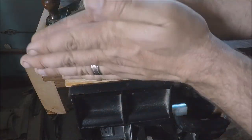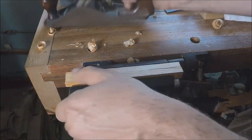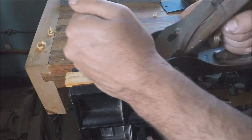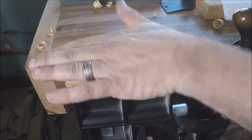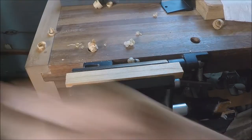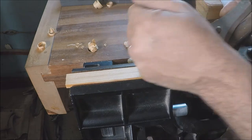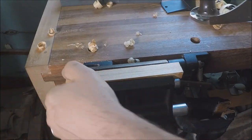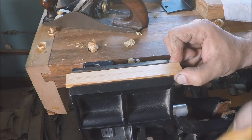I've taken those two pieces, laid them together, and lined up the ends. This is just a saw cut edge — it's a pretty decent cut, but it's just not going to clamp up very well. There's always the fear that you might plane angled one way or the other, but if you lay them together like this, when you close it up it should be complementary. We try to make it nice and flat anyway, but this will make it a little bit easier to put everything back together. Let's see how that works — it looks pretty good, should be good enough to glue together.